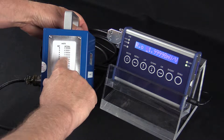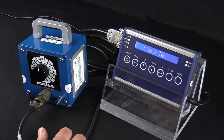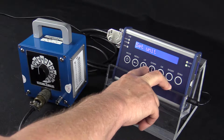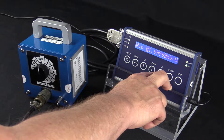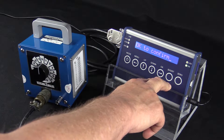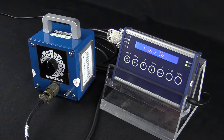the CX box gives an output of 1.9998 millivolts per volt, and that's what we enter on the screen. For your calibration you can enter any value you need. Once you have the value entered — using the up, down, left, right keys as before — hold in the OK button, and when it flashes click OK to confirm. The value is now stored in the 9330 and we've finished the calibration steps.